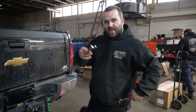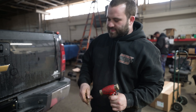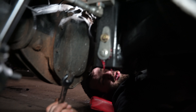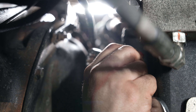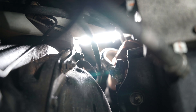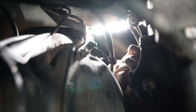Flashlight for starters, seven-eighths wrench, and then you'll need your brass hammer and brass punch to knock the pin out. Next step, you're going to remove the in and out lines that go from the check block to the back of the cylinder — it's these two right here. Best way to do that is with a seven-eighths stubby. Got the first line off, now I can get my wrench on this one.